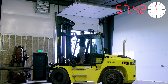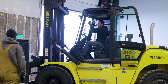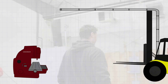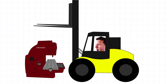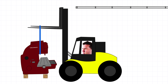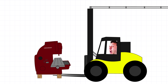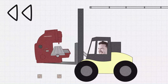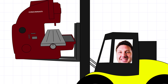The original plan was to pick it up with some chokers, but the milling machine is sitting flat on the floor and I cannot get the forks underneath it. My next idea is to grab it from the top, choke it, and drag it onto the trailer — but the mast is hitting the garage door. So I'm going to use it to put some dunnage underneath to grab it from the bottom. This forklift has a 21,000 pound load capacity on a two foot center — anything outside those parameters and I could tip the forklift or not be able to turn. I have to have the milling machine as tight as possible to barely lift it, even then it's really balancing on that teeter point.